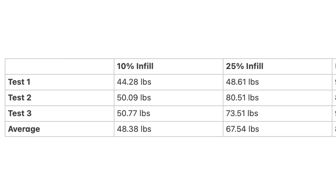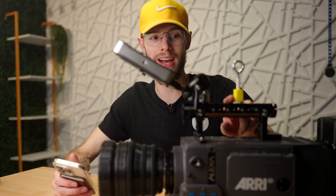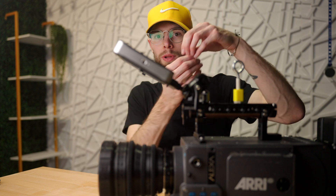For 25% infill we got an average of about 67.5 pounds — that is a great score, and 25% infill is pretty common; it's what I use most of the time, between 20 and 30%. Then for 50% infill the average is 89.5 pounds, which is an amazing score for just this little piece of 3D printed plastic. Especially considering the way this is printed we're pulling the layers apart, so the strength is really affected by layer adhesion itself — I'm really surprised to see numbers this high.